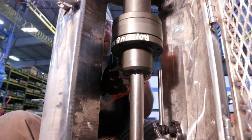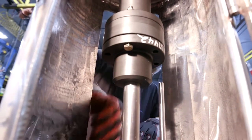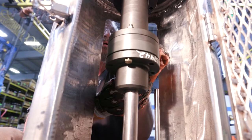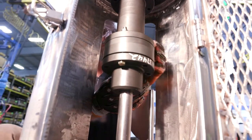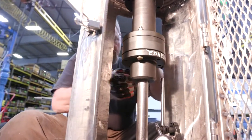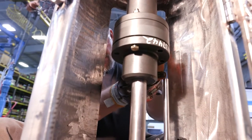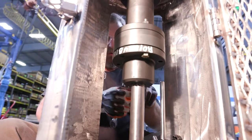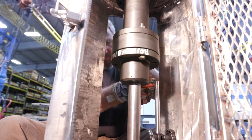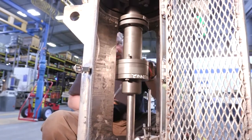I'm going to install these bolts — one on this side, then turn and install one more on the other side, so we're 180 degrees apart. We're just going to snug these up. In this case we can turn this; normally you would be turning the motor. We snug this area up and once these are snug, we check both sides again and snug them up.